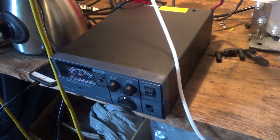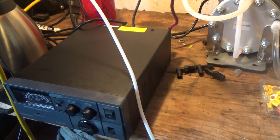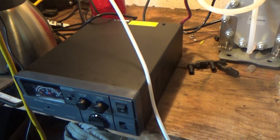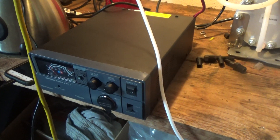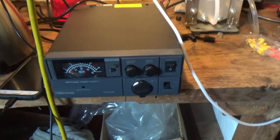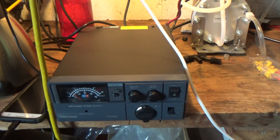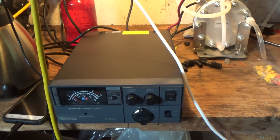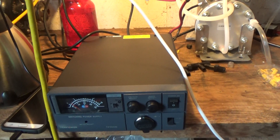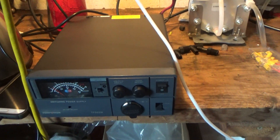So what do we learn from this? Electrolysis is current-dependent. During that run we actually went up to about 34 amps at 13.8 volts, so that's a lot of wattage, and obviously it makes a huge difference in the output.